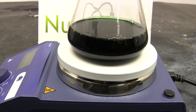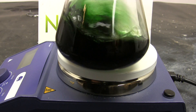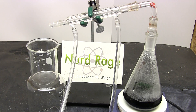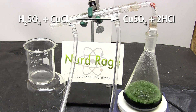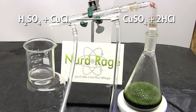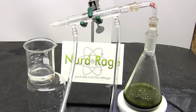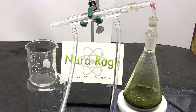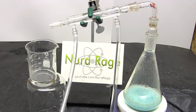Take out the air tube. Here's our solution containing a mixture of copper chloride, sulfates, and sulfuric acid. Now we put it back on distillation and distill off hydrochloric acid, keeping going until the residue is pretty much dry. What we're doing here is converting the copper chloride into copper sulfate — the removal of hydrochloric acid drives the equilibrium to the right. Now if you calculate the stoichiometry, you'll find we use an excess of sulfuric acid. This is to ensure we drive off all the hydrochloric acid and ensure negligible chloride contamination in our copper sulfate for the next step.